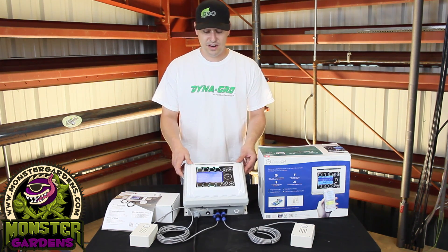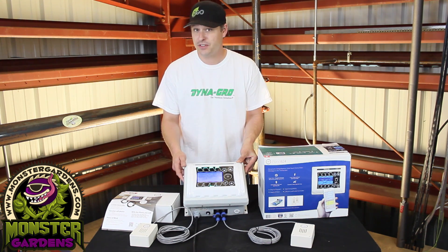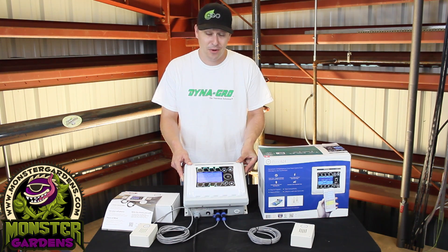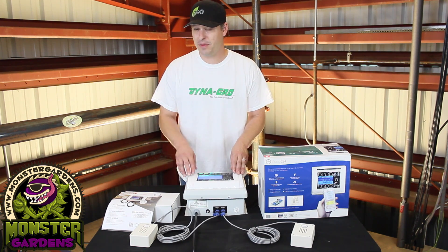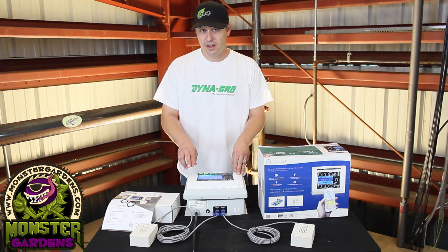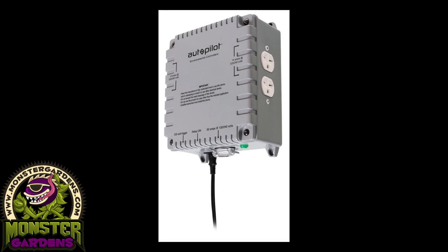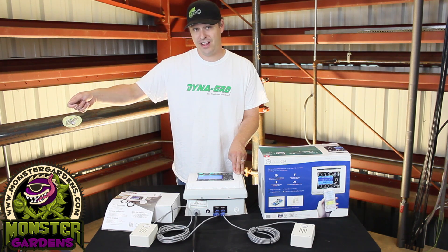This does need a dedicated hardwired source in order for it to work properly. It is only on a 15-amp fuse, and that's why you would need to plug the trigger cord in — because obviously it's not capable of kicking multiple thousand-watt ballasts at only 15 amps. The way you would run 240V with this 120V controller is to take your 8-light, 4-light, or 6-light controller — whatever you have — and plug the trigger cord in here, then the 240V ballast cord into your 8-light controller.